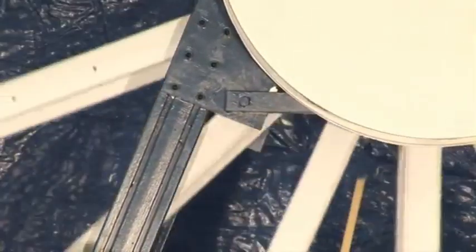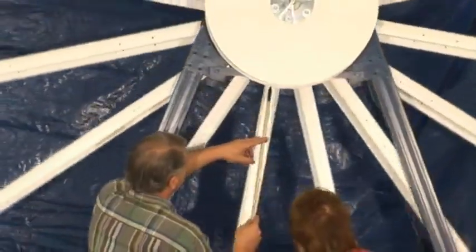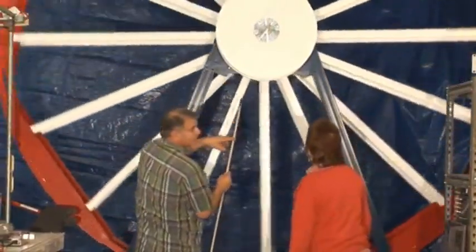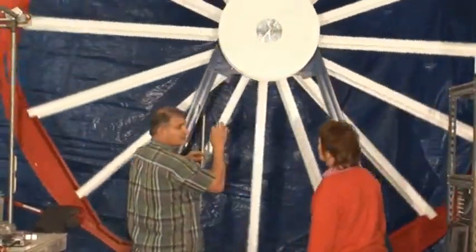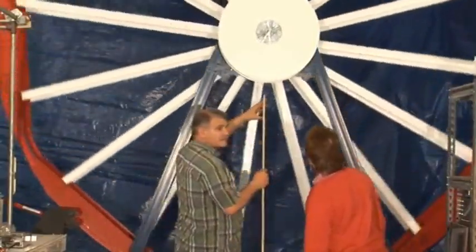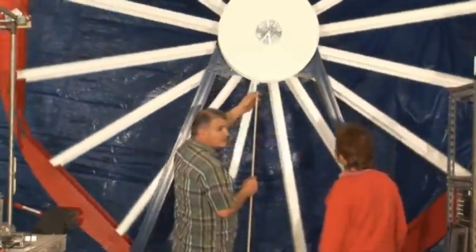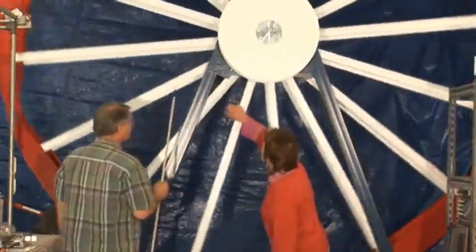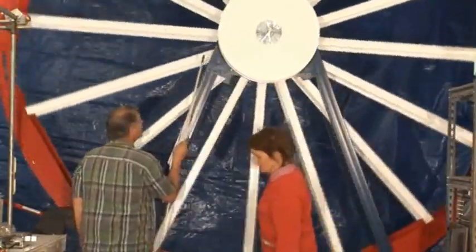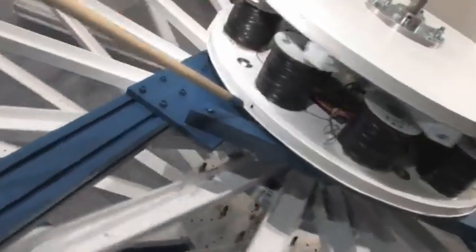There's a metal back here and a metal back right here. It fires this and makes a U-shaped magnetic field that gets shorted out against the next magnetic field. So when it fires that and the magnets flip direction, they automatically get sucked into the next pole with zero current — there's no current. It hits that dot there, fires, and by the time it meets this hole here — when this dot meets this dot — it fires, and that's when it shakes.